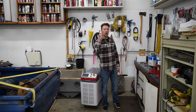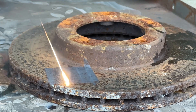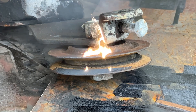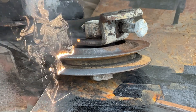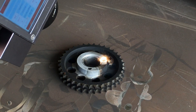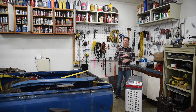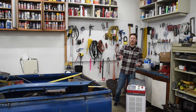Let's go over the two types of laser cleaning machines: pulsed versus continuous wave. This is a pulsed laser cleaner, which achieves efficient material removal through a process called ablation. Each laser pulse delivers a high energy density to the surface, causing rapid heating and vaporization of the contaminants, such as paint, dirt, or rust. The sudden expansion of the vapor generates a shock wave that effectively removes the material from the surface. It may look like a solid laser, but we're talking thousands of pulses of light per second — too many for us to see with our eyes. Because of this, pulsed machines require much less power than continuous wave machines. Continuous wave machines use a constant higher power that incinerates whatever is on the surface with high heat. Continuous wave machines usually start around 1,000 watts and go up to 1,500, 2,000, even 3,000 watts.